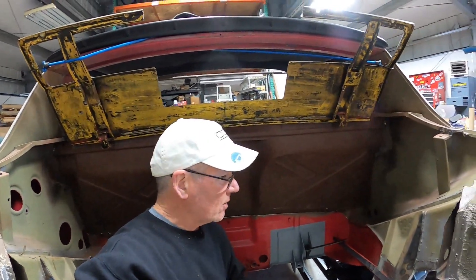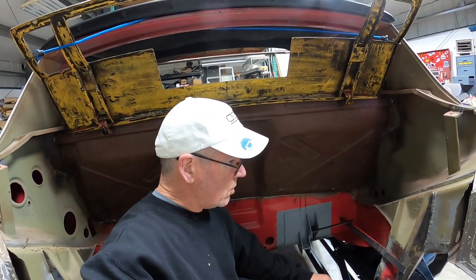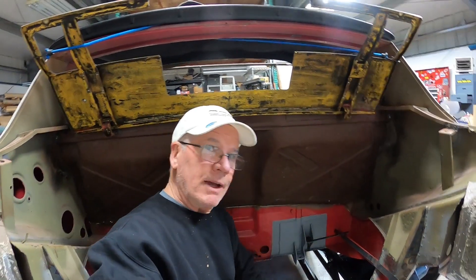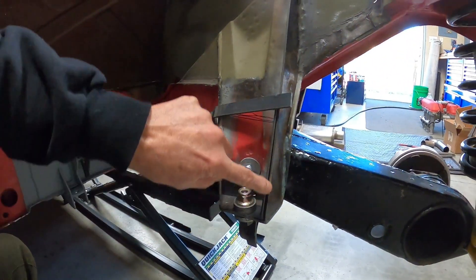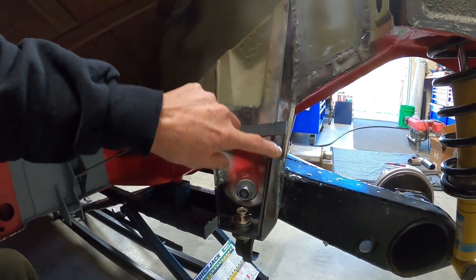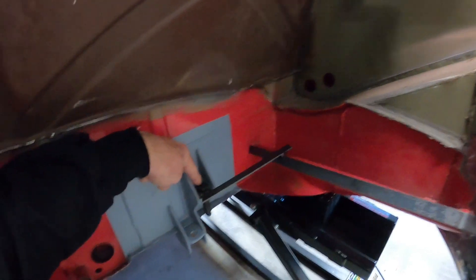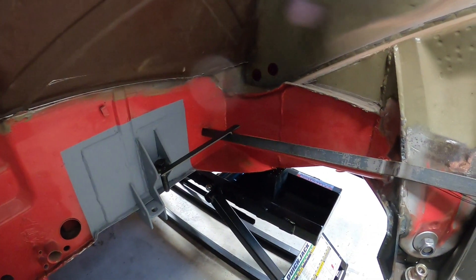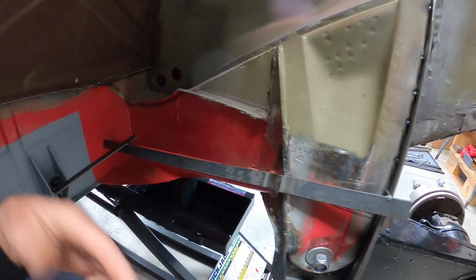So here we are in the engine bay, and the key design goal is to be able to drop the engine out of the car without taking the headers off. So what I needed to understand was how much room I have to build that model while being able to build it with the engine outside the chassis. I built a simple bracket contraption that bolts to the console, copies the dimension of the rear plate of the suspension console, then copies the position in space of this support strut bar, holding it in place so it can be bolted to the engine cradle at the front. This gets bolted to the engine cradle with the engine out, and I can model the headers knowing that if everything clears this, it'll work inside the car.